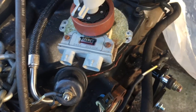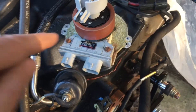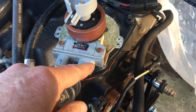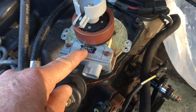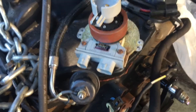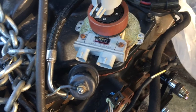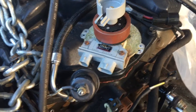Back in the 90s this was called limp home mode. In limp home mode, there was a signal going out to the computer to run the injectors, but there was no spark timing coming back to the module. Those modules also had a built-in timing curve, but for cars and trucks it was pretty different than the marine application — from memory, there was nothing up to 2,000 RPM, and at 2,000 RPM it advanced about 13–15 degrees fixed for limp home mode.